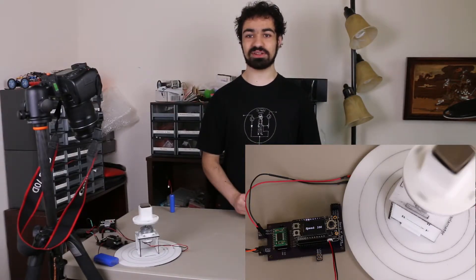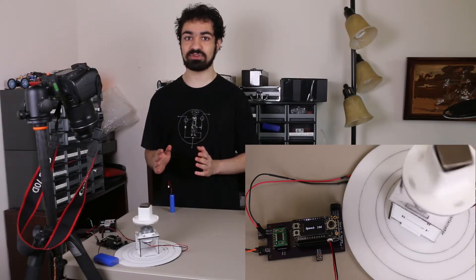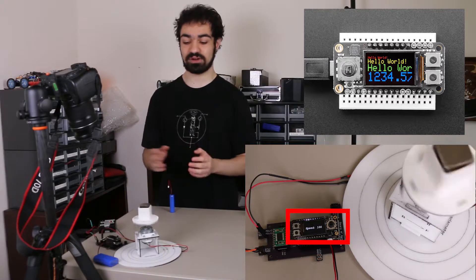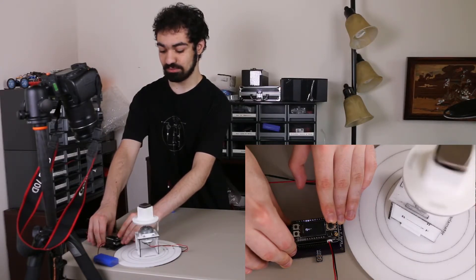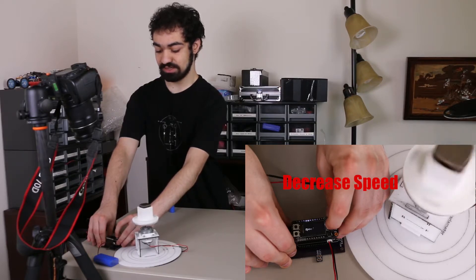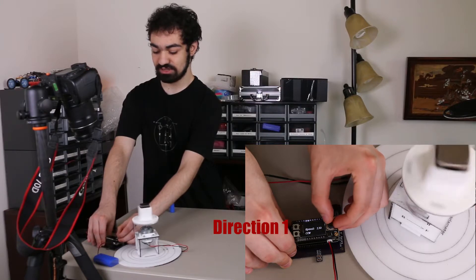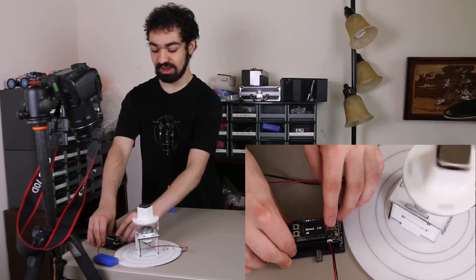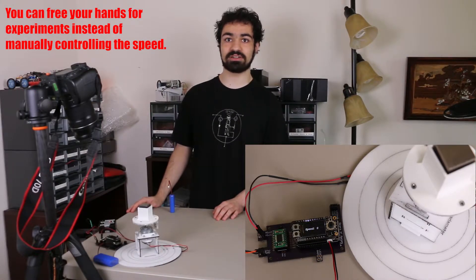Not only did we advance the EMF meter itself, we also advanced the turntable setup used so frequently in our experiments. Now, instead of there being a separate joystick contraption away from the main controller, we're using a TFT joystick featherwing, as seen here, to control the entire turntable setup. If I push the joystick down, I increase the speed and the motor increases at a proportional rate. Pulling it up decreases the speed. I can also alter the direction by pressing side to side — it switches direction, and pushing it back returns it to its original direction. If I press downward on the button, it automatically stops. It maintains its speed whether or not you're holding onto the joystick, unlike the previous model.